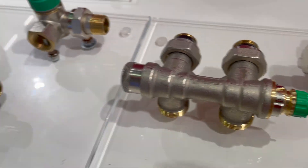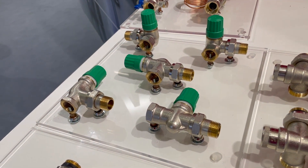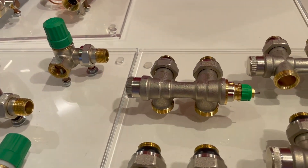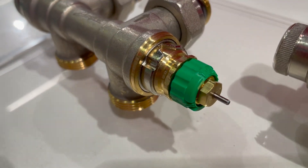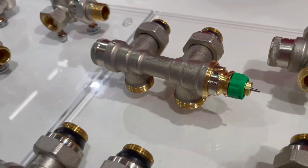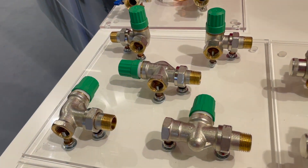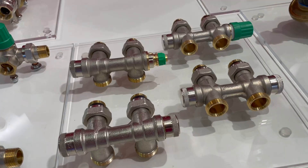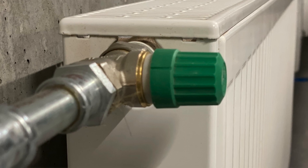It regulates the same as standard RADV dynamic valves, and it's very convenient — no need to change anything. Just put the HPs with integrated dynamic valve and all you need is to set the flow. In one project, some radiators can use RADV valves and some can be mounted with dynamic HPs, and they both don't need additional balancing valves up to 60 kPa.